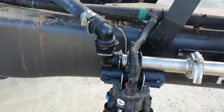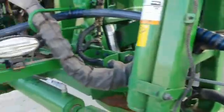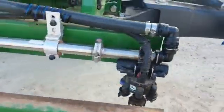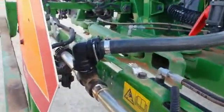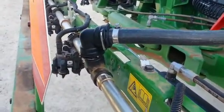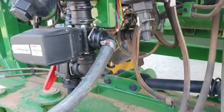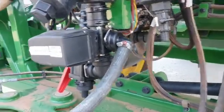Then we come into the centre. The hose runs around back to the edge. Then we come back to the centre fold where you've got your inch nipple with a T5 elbow. T5 straight to 25. Up there to a T6 elbow to 25. The valve.